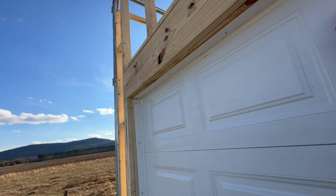All right, not gonna be today, but pretty certain I can handle that. Check this out. Everything looking good. Now she's flush over here, and I put the gap up here because I'm gonna put shims behind here to bring this over to take care of that gap. I got shims at the house. I just forgot to throw them in the car. So pretty certain I can handle that. Not a big deal. So I'm pretty proud of that, you know. For somebody who don't know what they're doing. Remember, not a professional. As if you can't tell by watching me work.